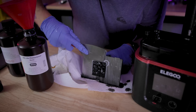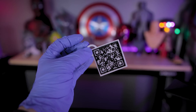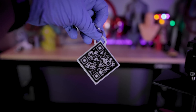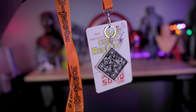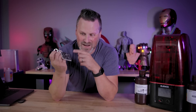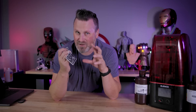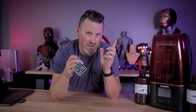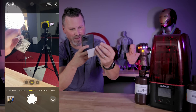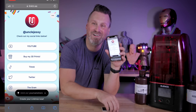I've got a flex plate on here so I can just flex this off. I got it! We're going to get this cleaned up, and here it is — my resin 3D printed QR code. I'm honestly surprised how well this worked. It didn't bleed — I thought for sure the black and white were going to fuse together and be foggy, but there's a really clear distinction. This is actually a great way to create not just a QR code but multicolor resin 3D prints by pausing and swapping out the vat of resin for a similarly-setting resin. Let's pull up my phone's camera and see if the QR code actually works — I think it does! That is amazing, that worked so well, I'm so impressed.